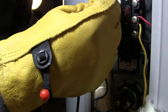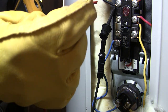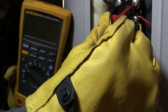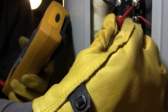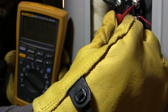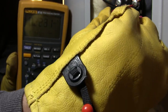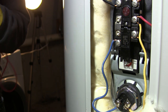We're going to set our meter to voltage. I've got probes that hook onto the terminals. I'll hook across those top two — and you can see there's 0.2 volts, essentially nothing. Make sure you're measuring AC on your meter, not DC, otherwise you might have problems. I'm measuring AC right now and I'm getting zero AC volts across that top — which makes sense since I cut power to it. So there's no power. Now we'll hook up the hose and drain.